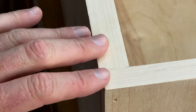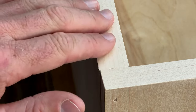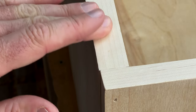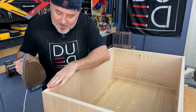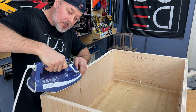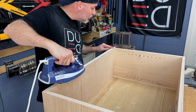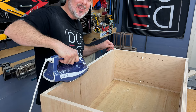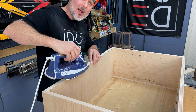Leave this alone for about a minute or two. Let the glue dry and set up — just leave that one section alone and let it cool so this won't slide anymore and that seam will stay perfect. It's been about two minutes and it isn't going anywhere. The glue is set and firm. Now we're going to take our iron and iron the rest of this piece to about an eighth of an inch, if not a sixteenth of an inch, right up until this next edgebanding seam.